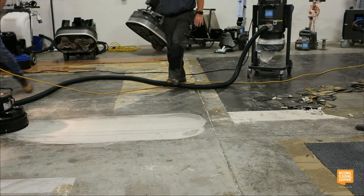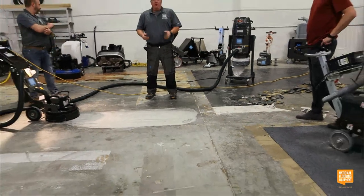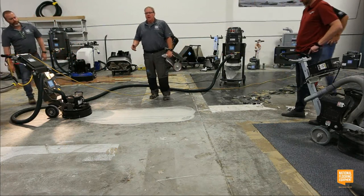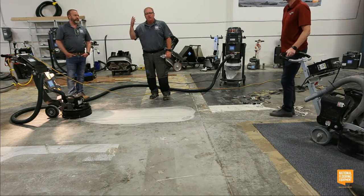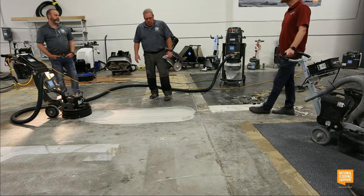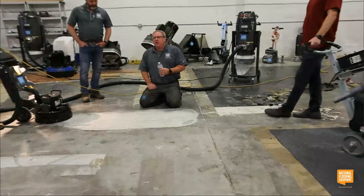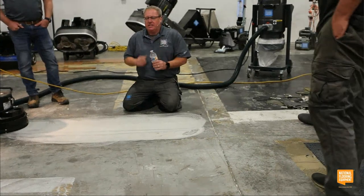That is a great question. I'm glad you asked. The question was, how do I know when I've ground enough? Because I see typically two ends of the spectrum: guys that don't grind enough, I don't even know why they're bothering, and guys that grind the floor until they're never going to make any money. Most guys eventually figure out the middle ground. The easiest way to figure out if you've opened up the concrete enough to take a coating or whatever you're going to put over it is called the dime test.